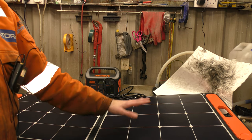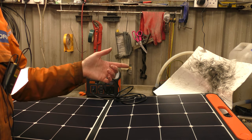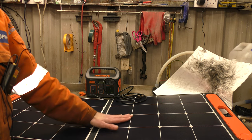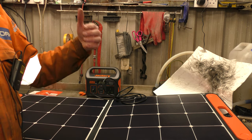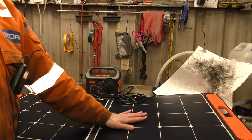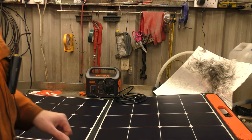Same as dust, dirt, any of these things. I think it was Google that did a study on their solar farms — simply by keeping the panels clean and washing the slight dust off them, they got 20% more output from them all the time just by keeping them clean. Anything that blocks the light makes a huge difference to solar panels.